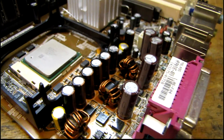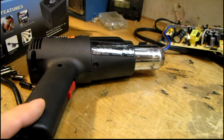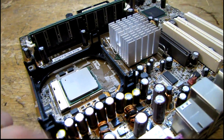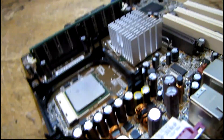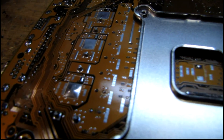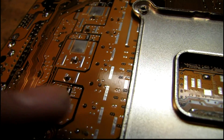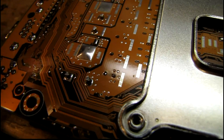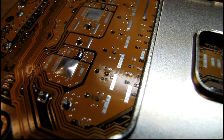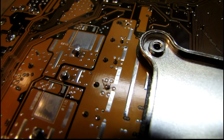It was kind of a pain to get the old solder off. What I ended up having to do was carefully preheat the board with the heat gun just enough to take the load off the soldering equipment. Here's a shot of the backside. There are a couple of stains — dark spots from the blue permanent marker I used to tell myself where the electrolytics were versus the polymers — but at least the new ones are all in place now.